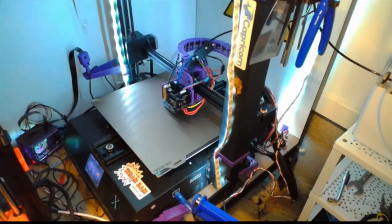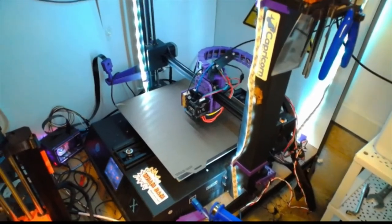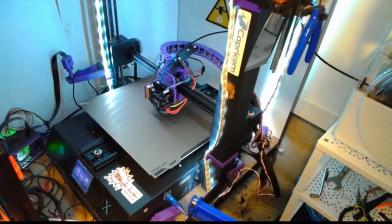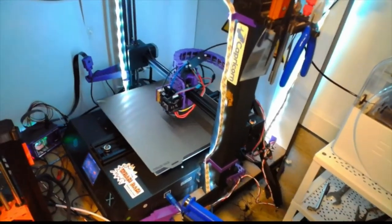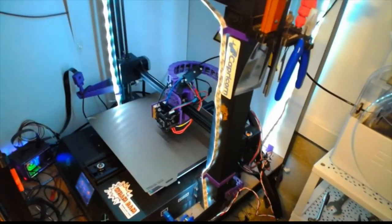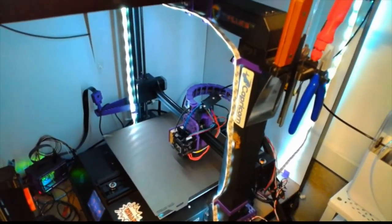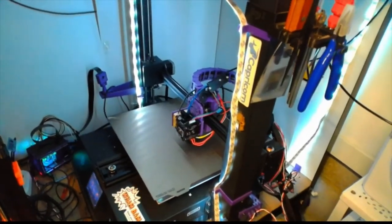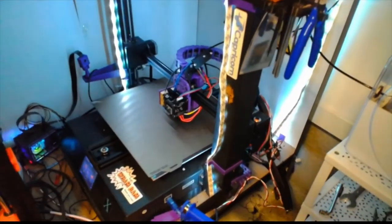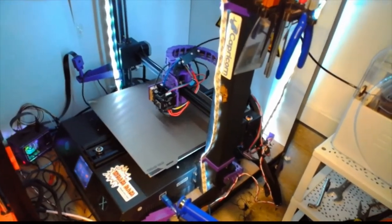But I've had to rewire bits of it because the way it came stock, it was putting too much current through some two smaller wires. And so eventually they were going to burn out. And some people didn't catch that in time and they burn components out. And often the manufacturer's happy to replace them and stuff, but that's a potential fire hazard. You don't want something like that, if you can avoid it, you know?